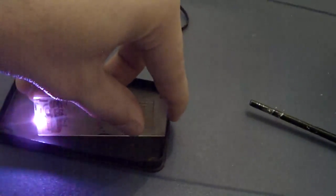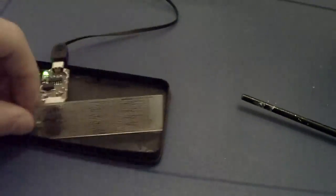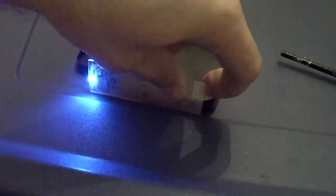I have my little AVR code, all the C over there on that side, and all I have to do is just type in make and program. And so now I should be able to pick this up, and if it worked, be able to touch it, yep. So I can get a whole array of colors depending on where I'm touching. I'm actually touching the glass side, so you can see that the electronics are here on the top side, but the touch sensitivity works all the way through the glass. That means you can have your electronics on the back side and you can touch on the front, which I think is pretty neat. I think I'm going to do something with it.